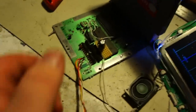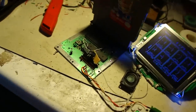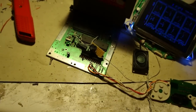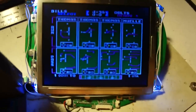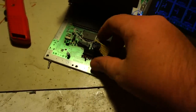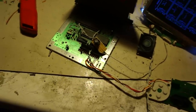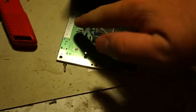Here's the video mod that I did. It's different from every other video mod that people have posted for the NES 2. The NES 2 is actually usually only RF video out, but there are a lot of composite mods and most of them are crap — you get vertical lines on the screen. You can tell there are no vertical lines on that screen. In the description there's a schematic. Compared to other composite mods, it's actually very simple — I think it's got like 4 or 5 parts, and one part actually comes from the board itself.